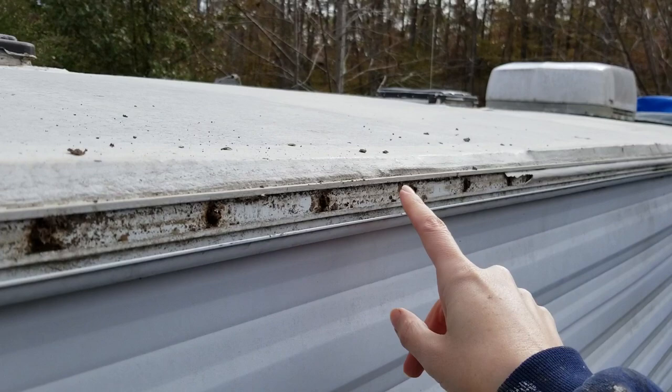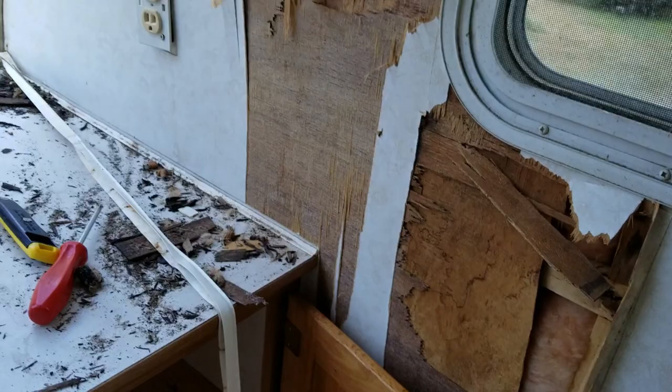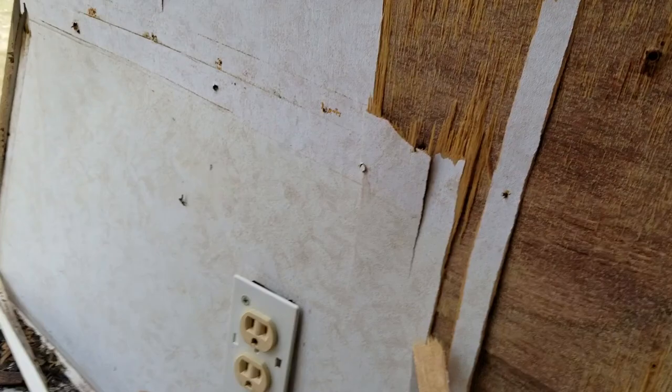Also be prepared to replace screws — these are pretty bad, obviously the water's been getting in there. I was hoping I would get to keep these lower cabinets and not have to mess with them, but since I've got some rot down here, I'm going to go ahead and take the cabinets out. It'll give me an opportunity to replace this whole length of board that goes all the way down behind the cabinet. Same thing on this side — I suspect there's probably some rot here too, you can see the water. To remove these cabinets, all you have to do is take these screws out. With these bottom ones, you don't have to remove any kind of hidden panels.